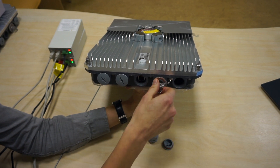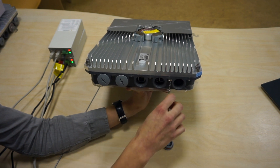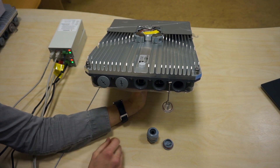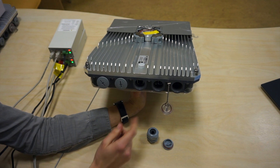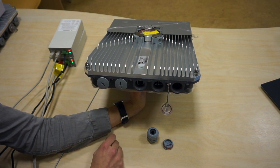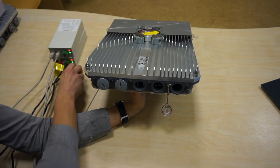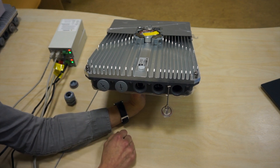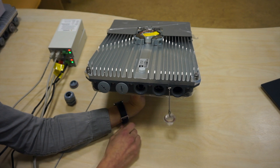It has an LED which acts as an indicator for RSSI. The more frequent blinking indicates a stronger RSL. There is also a USB-B port which acts as a serial interface, and there is also a 3.5mm jack that can be used to attach a voltmeter and do the alignment. Or you can also attach headphones and hear the beeping signal — the more frequent beeping indicates a higher received signal level.